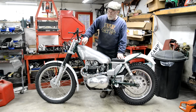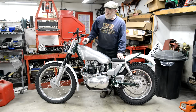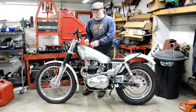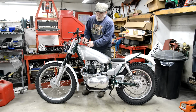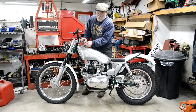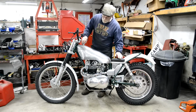But for those of you who noticed, the filler cap didn't have a vent hole in it. You're right, it didn't. So I drilled it and I put one of these two-way things on. Now when you normally buy these, they're on a little bit of tube, and the idea is they go on a sort of stub on here, and they stick up, look awful. But when I looked at it, the part that goes inside, I know you're a long way off, it actually has almost like a bar for the tube to go on. And I thought, I bet I could fit a couple of O-rings on there. So that's what I did, drilled the hole, a nice tight fit for an O-ring.